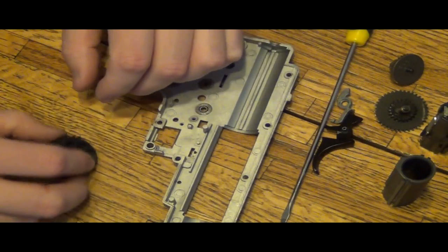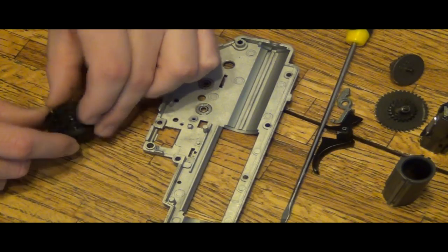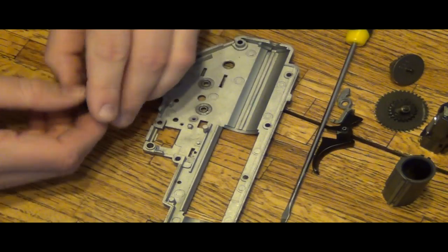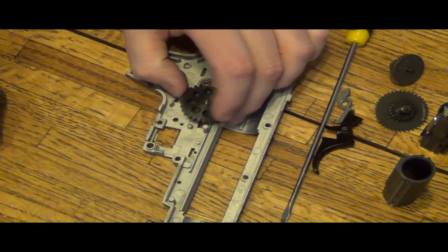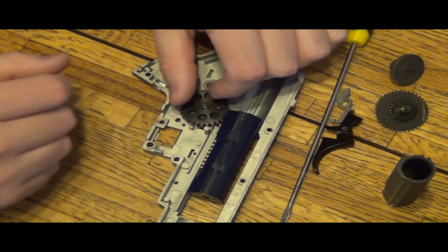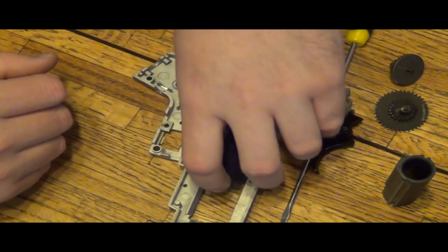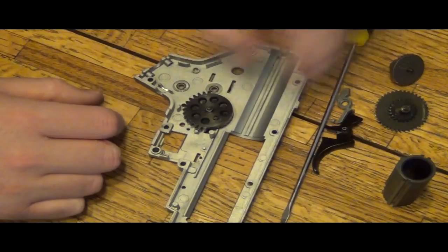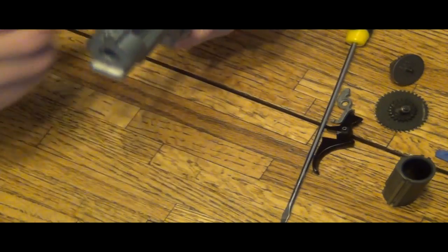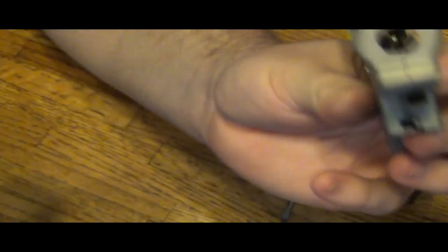But if you check something like spinning it, you have it stand like this and you check with a caliper, it still might look bent because it depends on how they cut these off. Sometimes they cut them off and they're not flat, and so you can't really tell here. The best way to tell is when you put this in the gearbox and you put your piston in there and you check it with it closed and screwed shut, it will actually have its resistance, and when you open it up you can see that there's a problem, and you can double check. But you can also take your gearbox shell here, close it up, tighten it down, and watch your spur or your bevel, your sector through this hole here, and see if it is actually going straight.